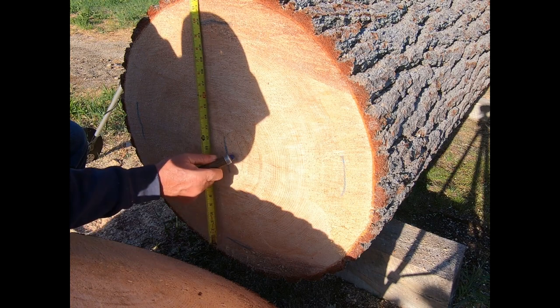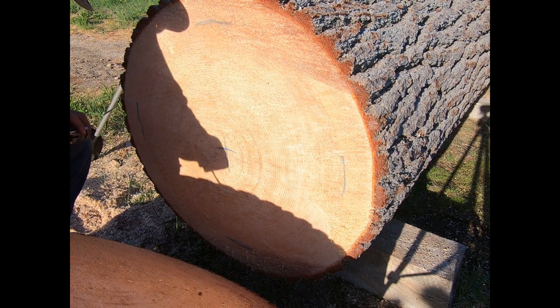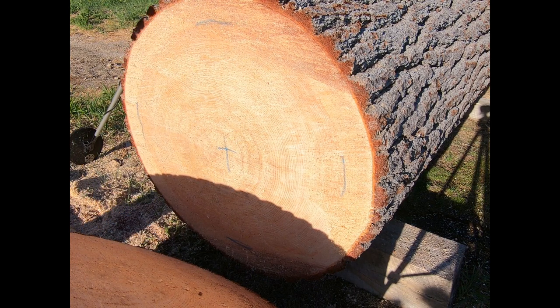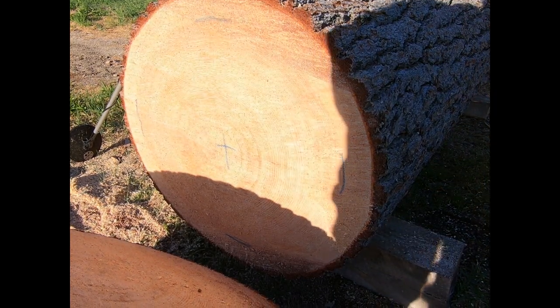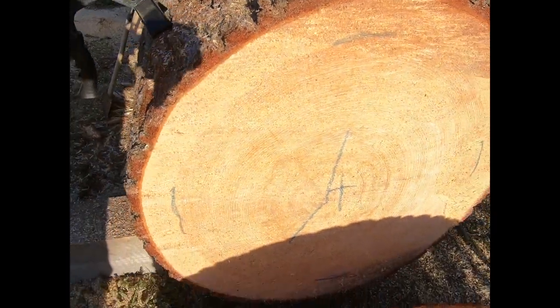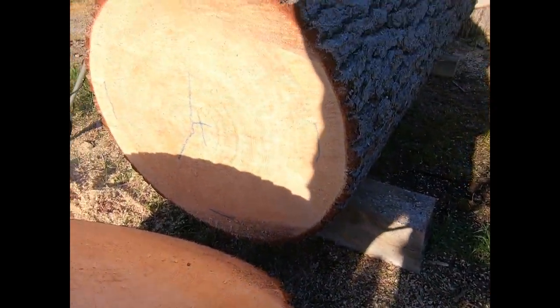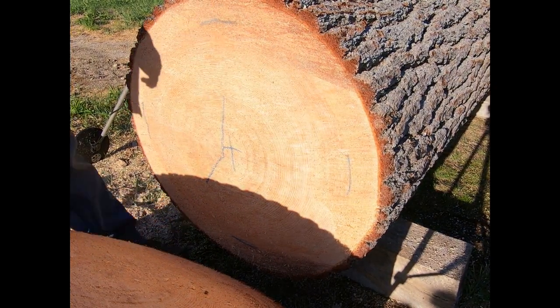Now 22 — we're going to hit 11 — right there. I'll show you the shake that's in this wood. For something that ain't been cut very long, I don't know if it'll bother the clapboards or not. See that crack right there? That crack goes all the way out from right there, all the way down there, all the way out there — pretty big crack. But we're going to be cutting our clapboards out here and out here, and if it does interfere, it'll just be maybe one or two. We'll put a half inch hole on this side. Regular bits work just fine.